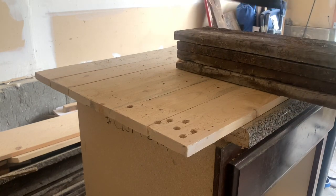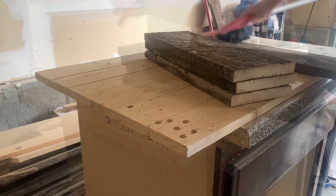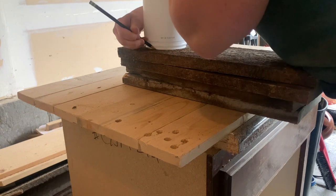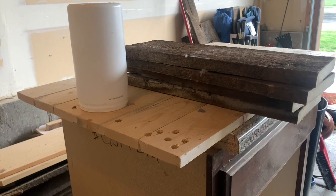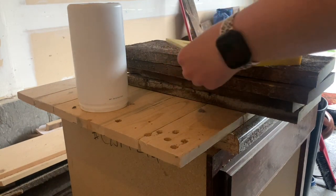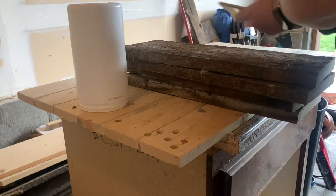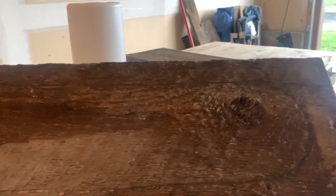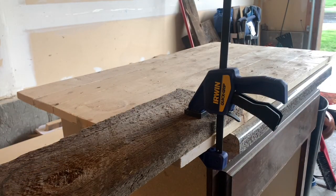So I just brushed off my wood — the barn wood has a texture that picks up a lot of sawdust. I'm cleaning it off before I really start working with each individual piece. Then I'm taking just a Clorox wipe container to trace a little bit of a circle — I want to do like an arch shape on this. I just trace that little half circle there. You could trace the whole circle and then use a straight edge to do a line down. If you even just wanted to cut a simple rectangle out, you could do that. I just like the arch look. You can see how that arch goes all the way down to the end and then it squares off. So now we're going to use our jigsaw to cut this shape out. I'm just going to clamp my wood so that way it's nice and secure so I can drill my pilot hole.